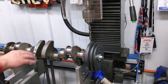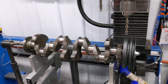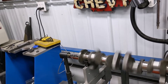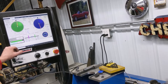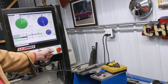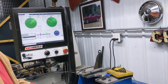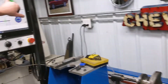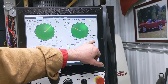So now I'm going to re-spin it — you can see my balancing holes. Now we aim to go within 1 gram. Right now we're at 1.07 grams and it wants me to drill at 302 degrees. We'll see where this is compared to my other holes.